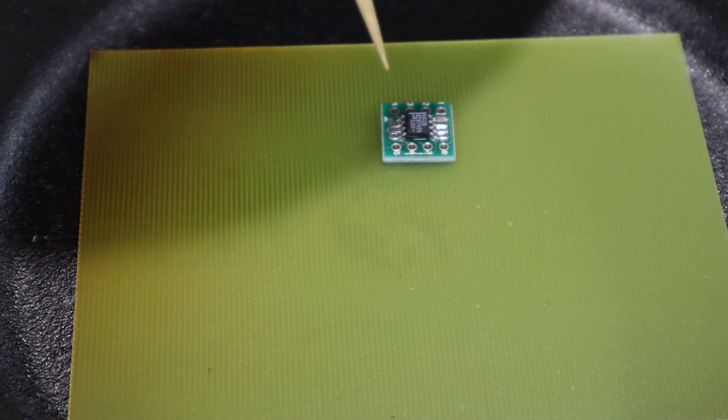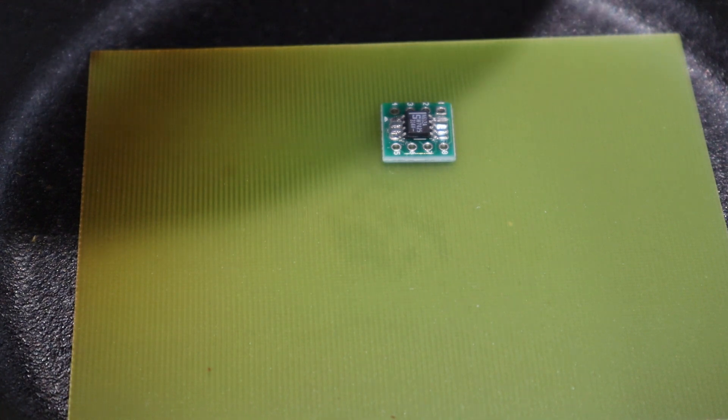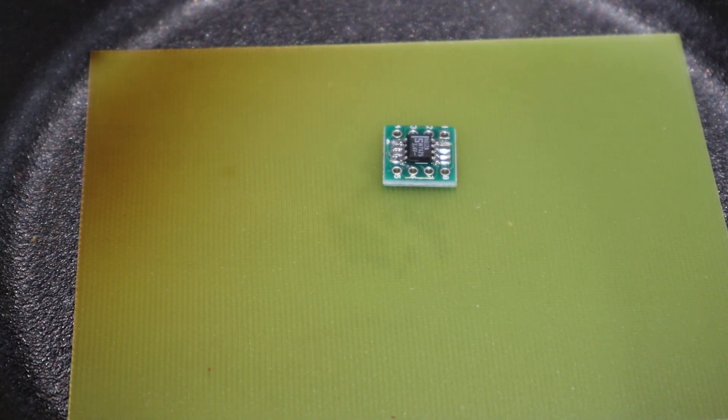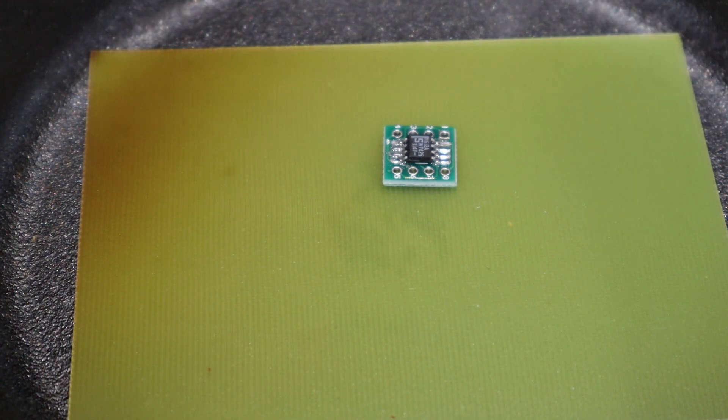I can cut my interconnecting wire or component lead with a little bend that's just the thickness of the board, stick it in there, hold it, and solder. Or if you prefer, you can use 2.54-millimeter headers — put two header strips in and insert the board into a regular IC socket for a friction fit.